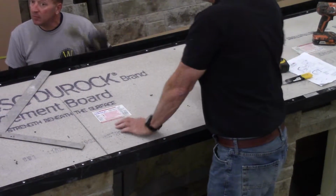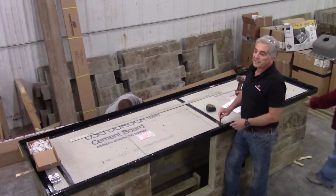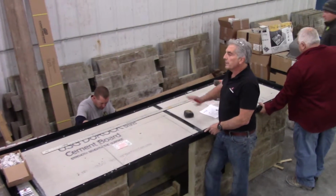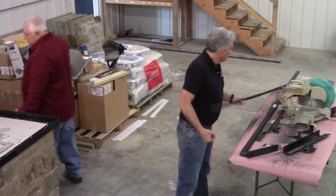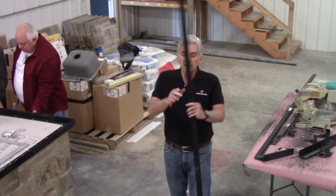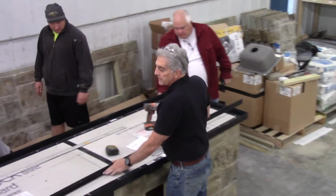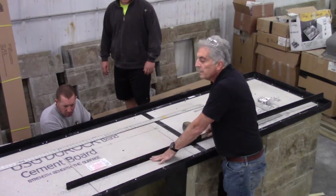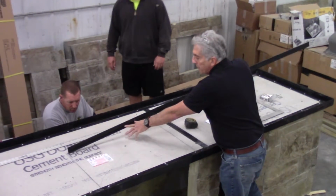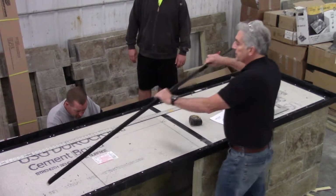Over in the top left, the back wall form, which is used, again, if you're using these in a kitchen and you're pouring this up against the wall. The back wall form is just like a little angle, but it has a little 3/16 inch top on it. So if you put this up against a back wall, you can screed off of this. But it also works perfect now for forming our dam that we're going to use for the cutout.